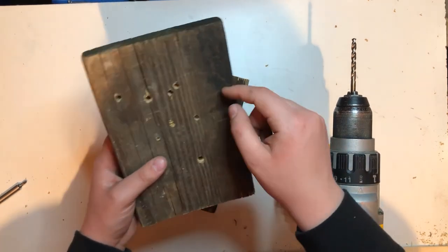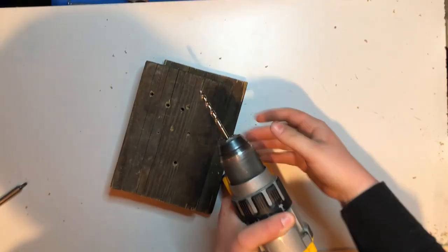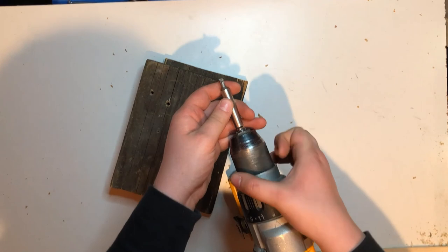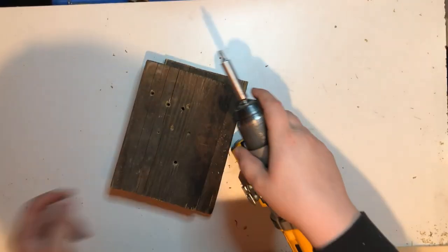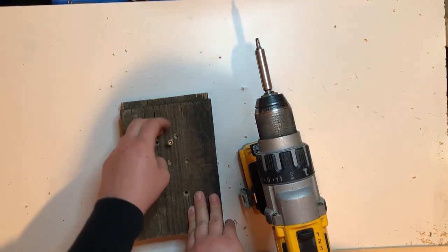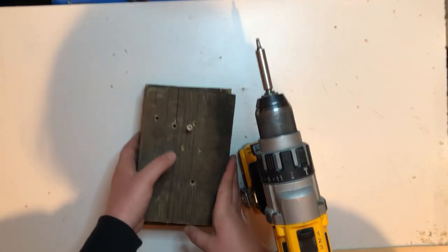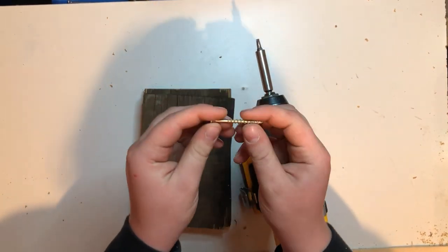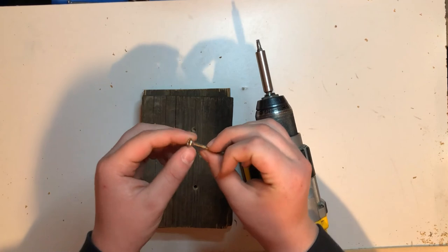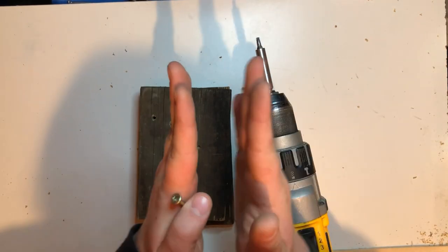So now I have this hole drilled. We can take the drill bit out and put in a bit adapter — I have a Torx tip in here — and lock it up. Now I have a Torx screw. What I can do is use this hole to allow the screw to pass through the first piece of wood and bite into the second piece. This allows a really tight fit: the screw only bites into the second piece, so the screw head and first piece are forced tightly together against the second piece.